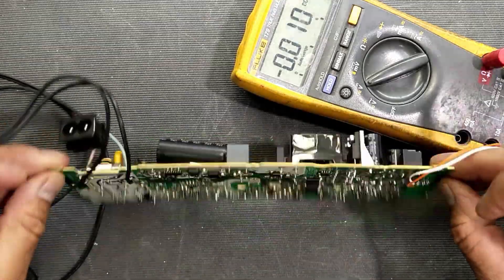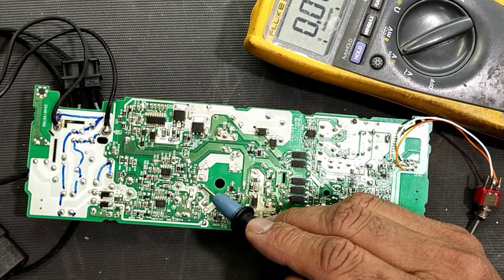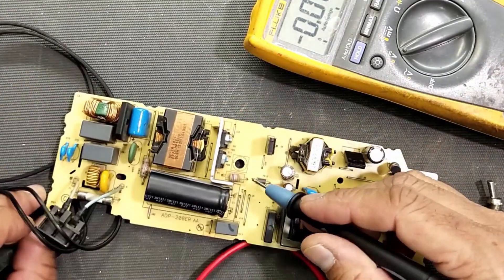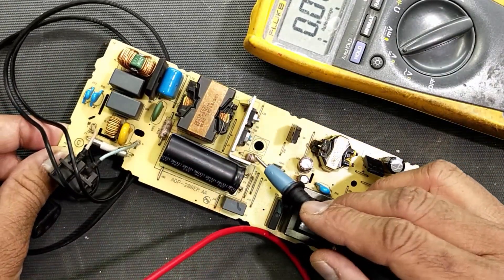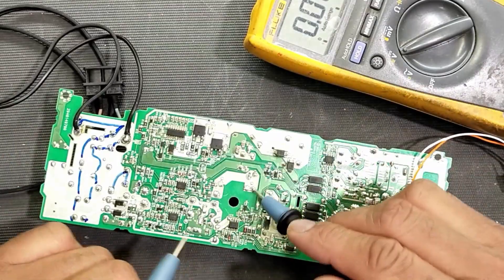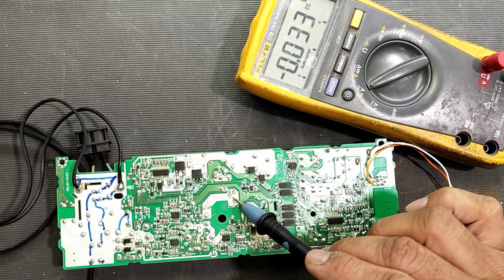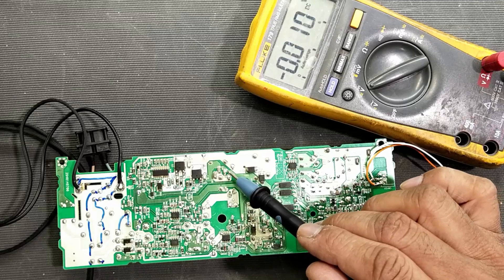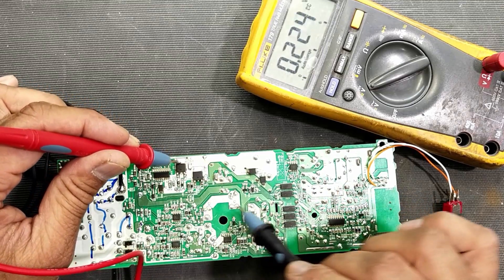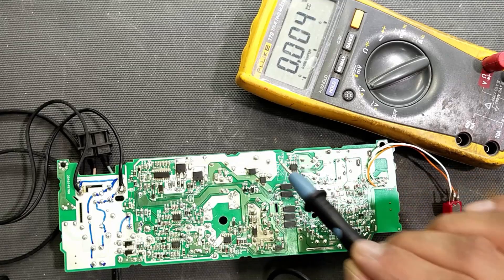At this point we have the capacitor, the PFC circuit, and the PFC coil connected to this diode. The diode output is connected through this resistor. Most of the time, if this series resistor is disconnected, our power supply will be dead — it will not work at all. In that condition we have to check this resistor. The voltage at this capacitor is then passed to this point. Negative voltage is connected here and positive is connected to the second MOSFET. These two MOSFETs will switch turn by turn to this transformer.